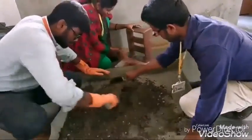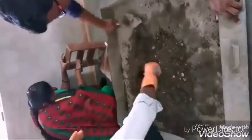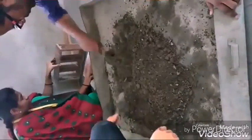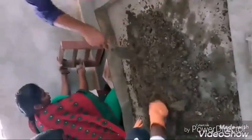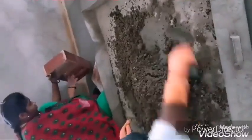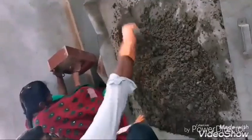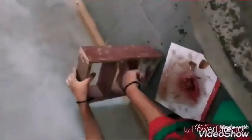After mixing, we use a standard size brick mould of 190 x 90 x 90 mm. Lubricant is applied to the inner sides of the mould. This lubricant helps during demoulding after the bricks have been cured for 48 hours in sunlight. Applying too much lubricant on the inner sides may affect the sides and surface of the bricks.